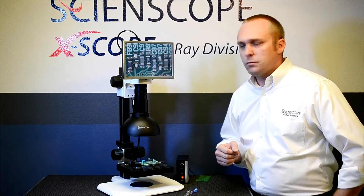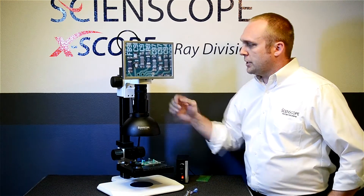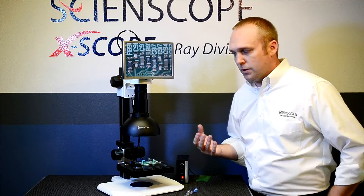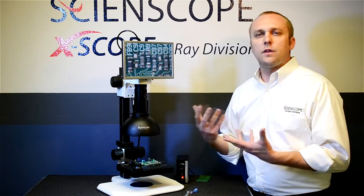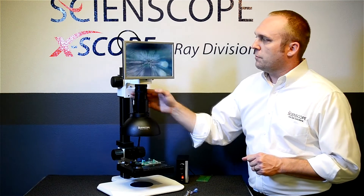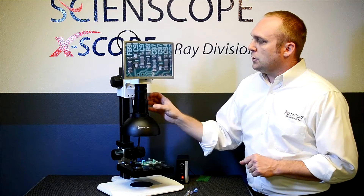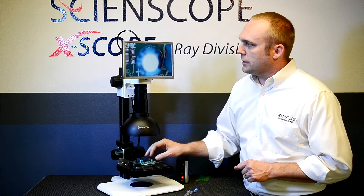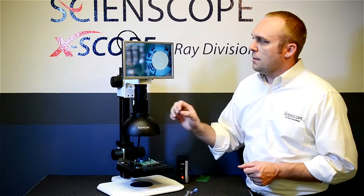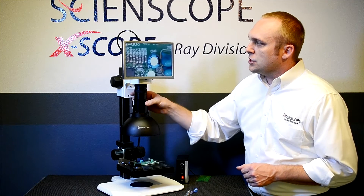The optics included with this system is a macro zoom lens. All of your controls are located on the lens itself, which is nice. You have your iris, which lets light in and out so you can control your light and also increases and decreases your depth of field, making it easier to look at things with varying degrees of height. Your zoom control lets you go from 40x at its maximum with a monitor this size down to your lowest magnification very quickly. There's also a built-in focus, so if you encounter a part that's a little taller than the substrate, it's very easy to just turn the knob and refocus the image. It's a very versatile, all-in-one lens — you don't need any additional lenses or parts.